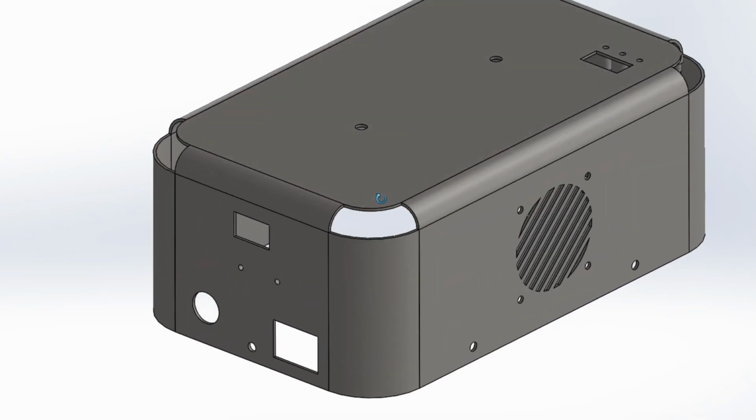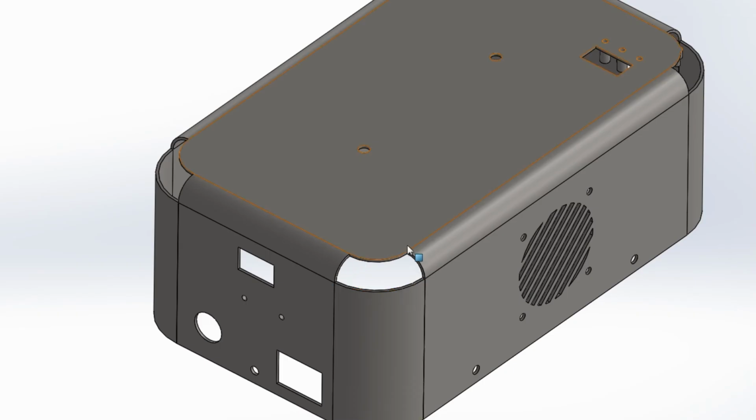You'll see pictures at the end of me doing the work with the press, with the wee bit of pressed steel over the tow hitch of a car. I didn't cut it off my own car anyway, but I think it was a scrapyard I might have taken it from. And the top part of the tool that I used was a bit of pipe at about 3 inch, and I pushed the stainless over it with no heat, and it actually worked out quite well. So you will see that in the pictures at the end of the video.